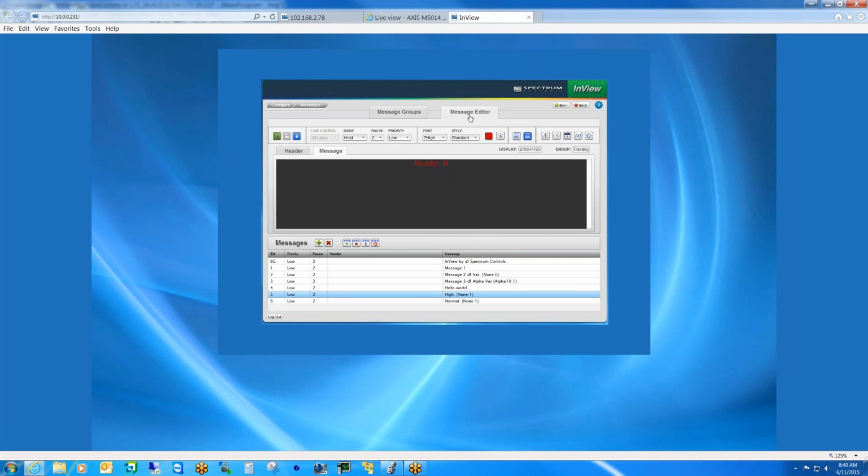The next step will be to change how the comms module communicates with the sign. Right now, it's done over a serial interface, but eventually we want to switch over to DVI. Once we do that, we'll have complete graphical control over the sign. Then we can roll in all kinds of stuff, not only animated graphics, but also being able to change the colors of specific elements without having to switch the message. So it'll be totally different when we get to that point. Gotcha.